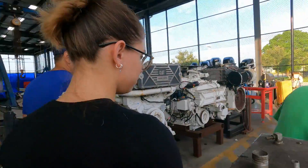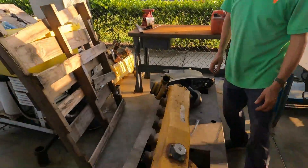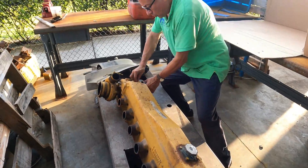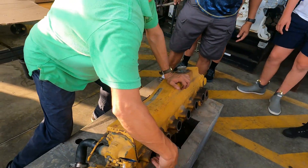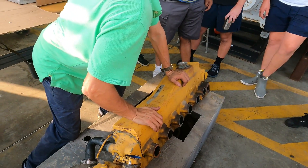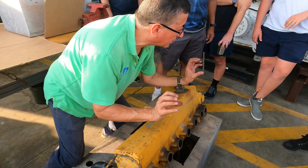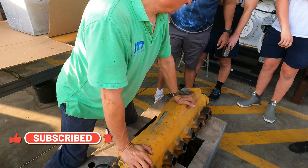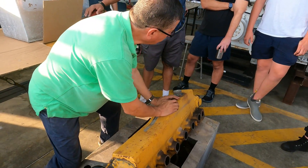Look at the manifold you remove from your engine. Salt water enters here, and here, goes to the elbow, and exits. The gases — because this is bolted to the exhaust — this is the exhaust manifold, bolted on the exhaust ports of the head. And what is this element on top? That pocket? It's the expansion tank.